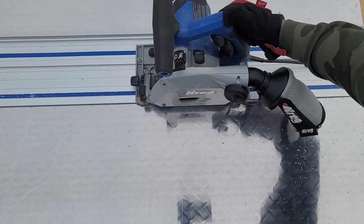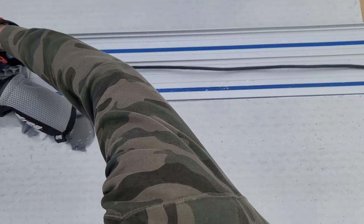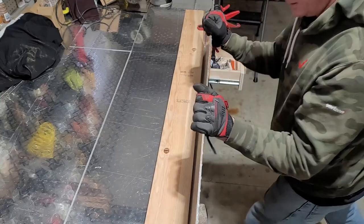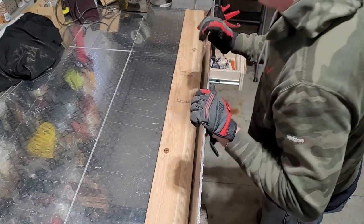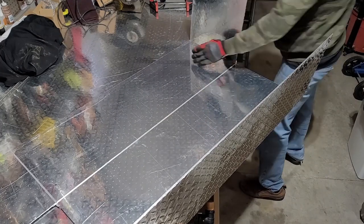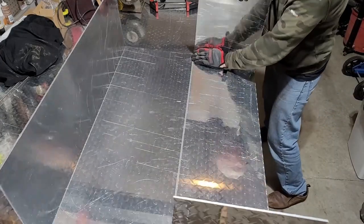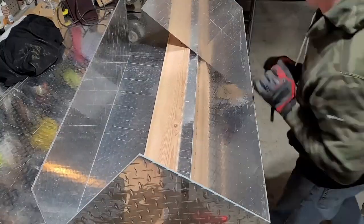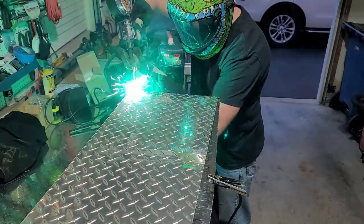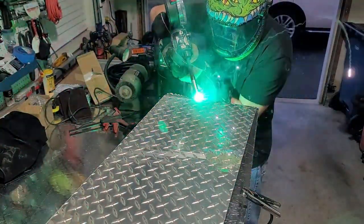I did make the width of the scores about the size of the material, so 3/16th of an inch. For the larger sides, I had to clamp it down in order to make the bends. The smaller sides were a lot easier — I was able to bend them by hand. Standing on it at this point made it a lot easier to finish bending. Scoring the back side worked out great; I had really good bends and it cut back on the amount of welding I had to do.